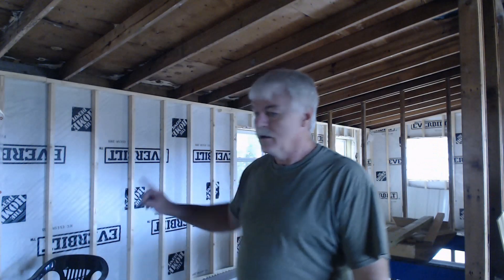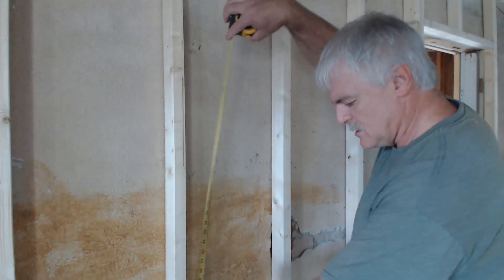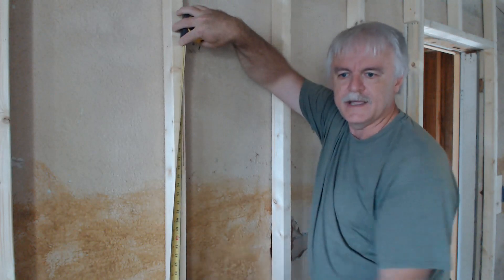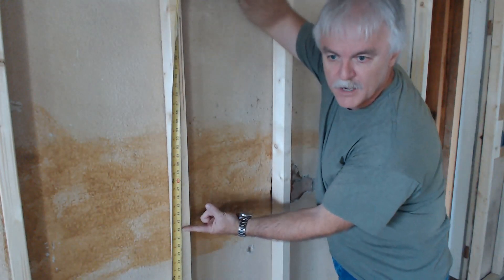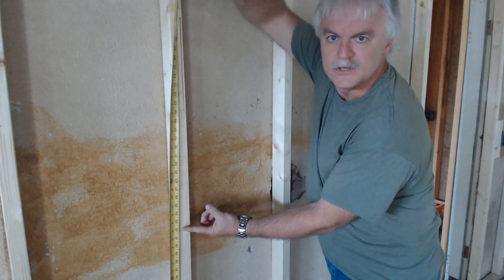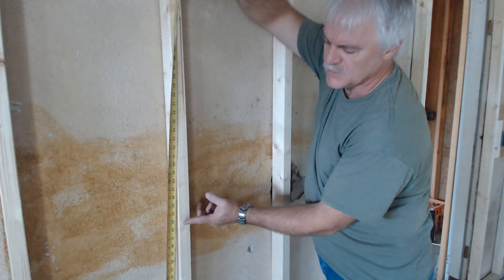I'm not going to bore you with much talking, but I will explain. When we put these on the wall for those in the kitchen area where there's countertops, or where the switches are, we'll put those to the bottom of the box at 42 inches. The bottom of the box will be right about here. Some people like to put them at 48 inches, but that's a little bit high for my liking. I'll do my switches at 42.